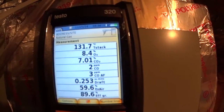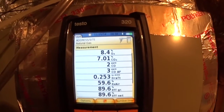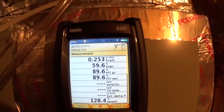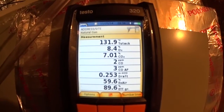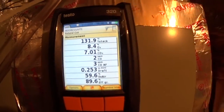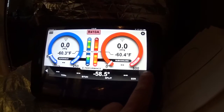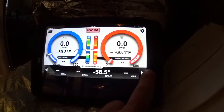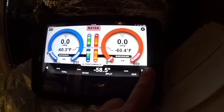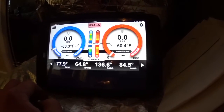But that's not too bad. The system is zoned, so we are getting some minute bypass from the humidifier as well as from the bypass damper — you're going to get a little bit of bleed over. I'd say that's not too shabby.